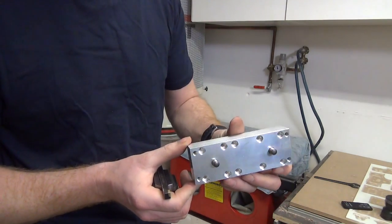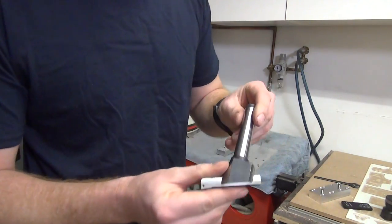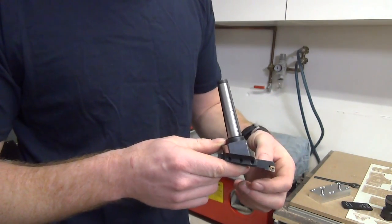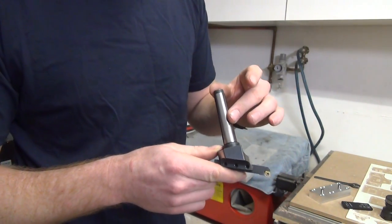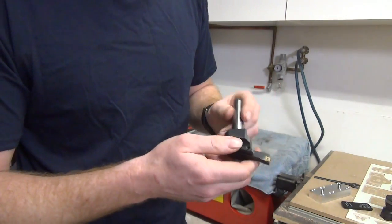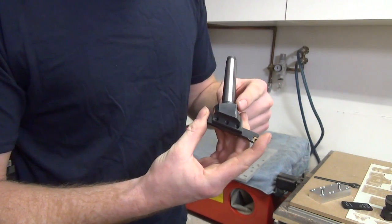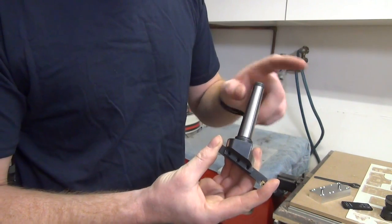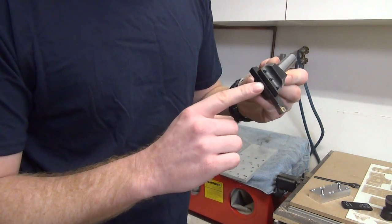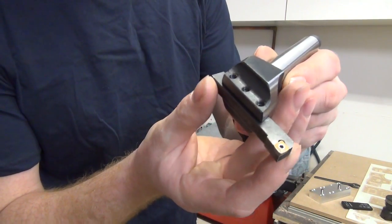First, this was the part I was facing off with the fly cutter, and this is the fly cutter itself. I will try to provide some links down below in the description box to this one or a similar one. I found this on eBay, but eBay links come and go, so I will try to find an Amazon link and provide it in the description below. This is a fly cutter which has a Morse taper — an MT2 — and I have a small lathe tool in there.